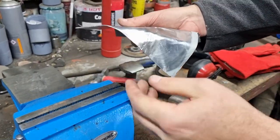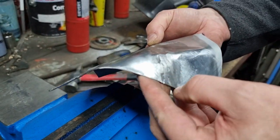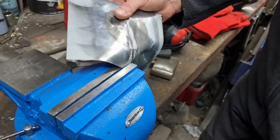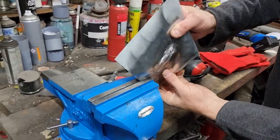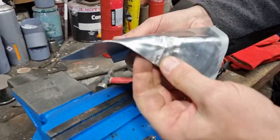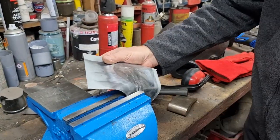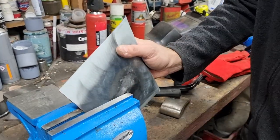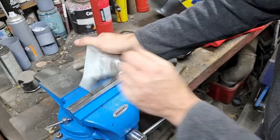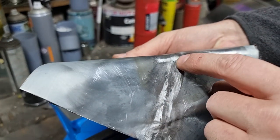So attacking it with the blow lamp has softened it, but I think it's already soft enough to be able to planish enough to work with, even though it's still harder than the surrounding metal. It's not cracking and falling to bits like I expected it would do. Oh, there it is now, because I'm doing that to it. See how it's cracked there now compared to the metal around it. Let's do that over there to see how that holds up. Yeah, that split there as well, but did take longer to split than that one did.